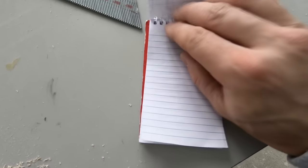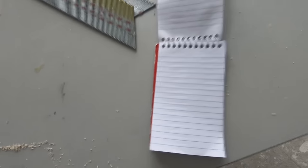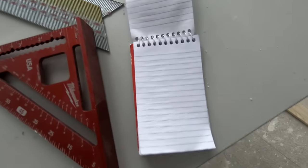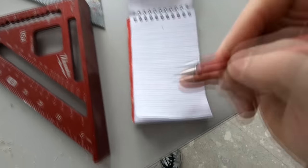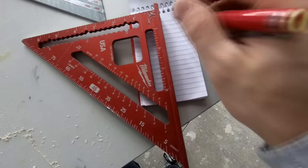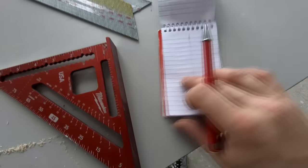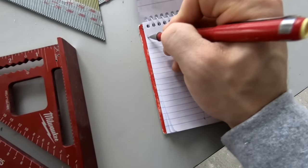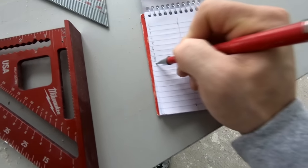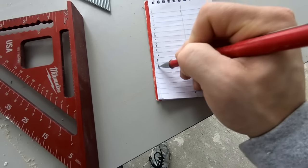Next tip is going to be on cut lists. I always have two cut lists in play — one is always clipped to my holder on the saw, the other is in my tool belt. Whenever I walk up to the saw to start cutting a new cut list, I'll take the cut list that's already clipped at the saw and put that back in my nail pouch. The reason is it's really easy to forget your cut list at the saw, and having two eliminates that problem. I like these little notepads and I've got them listed in my Amazon store under consumables.